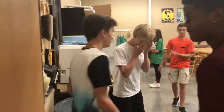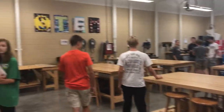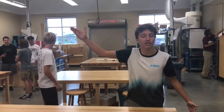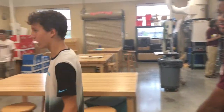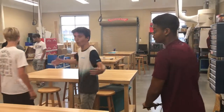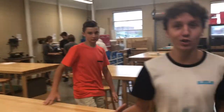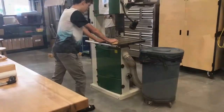Alright, now this is our lab. When using a machine, wait for it to come to a complete start, and before leaving it, a complete stop. If any kickback, spinning out of control, or breakage occurs on any of the machines, try to shut it down as soon as possible and then notify your instructor. Along with injuries, tell the instructor immediately. Always keep the protective guards on the machines in place unless you need one removed. If so, then talk to your instructor, because this is a special setup and you cannot do those alone. Also, no horseplay in the lab or fighting. That can be dangerous.